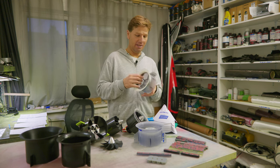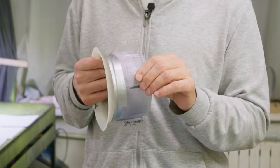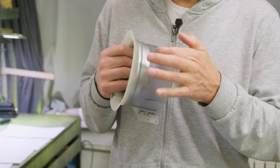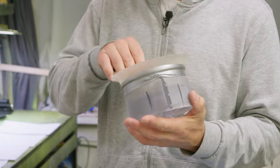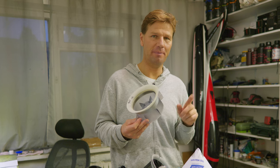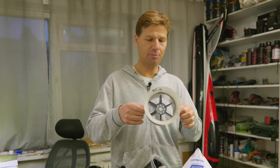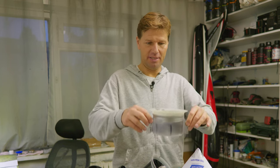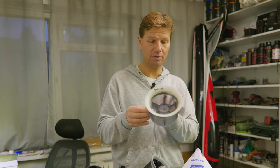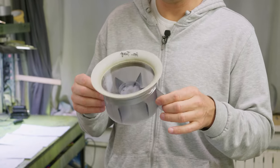When I got myself a resin 3D printer, all this post-processing work is not required, because the surface of the print is so smooth. The only thing you need to do is print it and then test it. One technique I discovered: you can mix isopropanol with 30-40% transparent resin, dip your finished hardened project in this mixture, take it out, let it drip off and dry in a warm room, then harden it again — and your product is shiny smooth. I tried it a few times and it works.